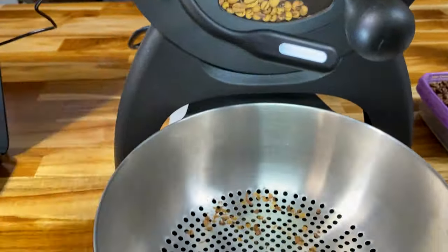You know, we have this hooked up to a Whirlybird on the roof, and you can feel the vacuum as it is. Any closer than that, we'd be taking heat out of the roaster. It wouldn't work as effectively. So try a natural draw. You'll be surprised what actually happens when you've got a heat source on the bottom and cool at the top, before you start to go for a fan-operated mechanical style. Yeah.